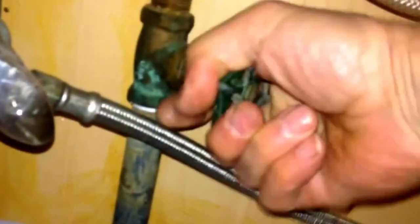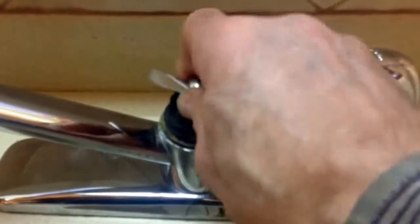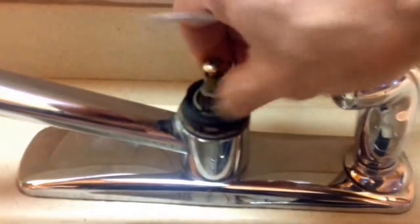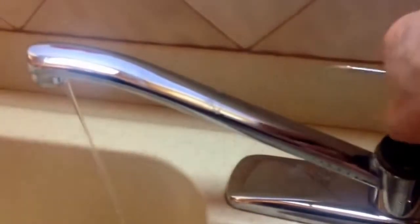We need to go underneath and turn off the valves for the hot and cold water. That's one that goes to the dishwasher, and there's the other one over there. You may want to relieve some of the pressure — put the screw in and lift up on it. Make sure you turn them both, hot and cold, and get this thing to drain out.